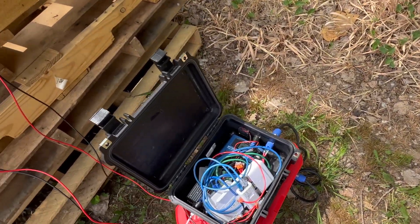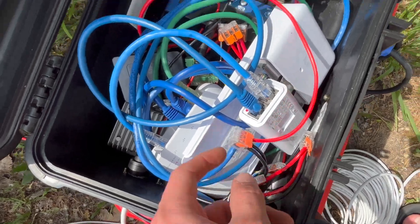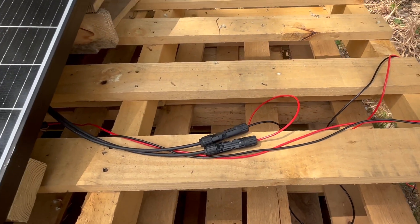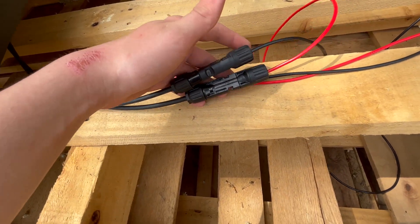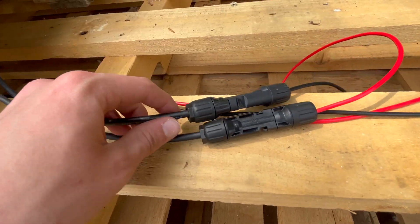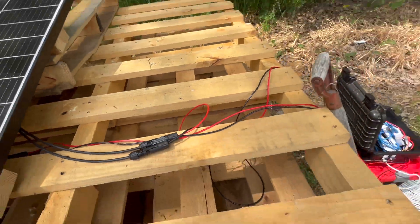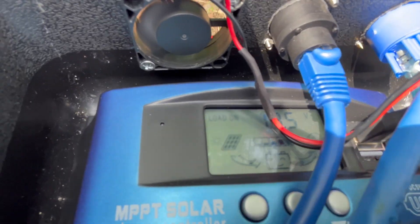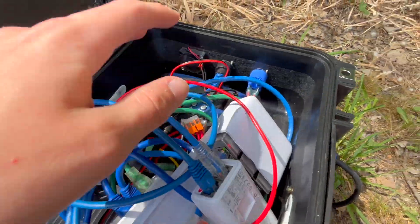So we are back. I have now connected the wires. Obviously the colors do not match, and that is because when I was making these solar connectors I custom made them. When I was making these solar connectors, I actually didn't know the polarity of them. This one is actually positive but I put a black wire on it. So I just had to reverse it right before it goes into the charge controller. But as you can see in there, we're at 13.5 volts — it is charging the battery. The battery is happy, so that is absolutely fantastic.